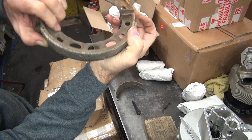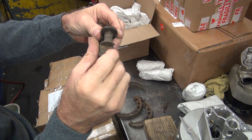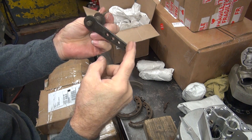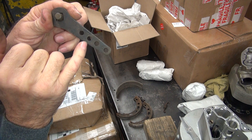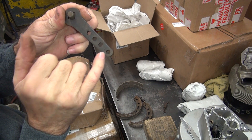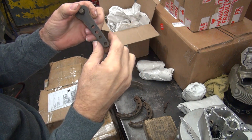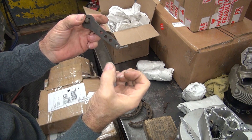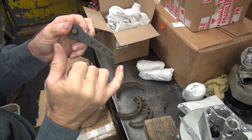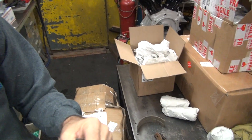So it goes in there like that. This shoe is damaged. And this here is the brake lever that goes on the end of your cam, and that's where you get your strength to work the shoes. The early ones in the 30s had four holes in it. So you got Solo - this right here is the second hole - and then Trike was way out here. That gave you more pull and more leverage on the shoe so you can stop harder, but you used up all your free play so it didn't really work that well. When you're a little bit closer, you had more travel but less mechanical advantage - you had to squeeze harder. But they had adjustability. Later on they just put one hole in there and you couldn't do anything. In the 30s they figured you're smart, let's put it where you need it. But they found out early on that riders are not smart - neither are the Harley mechanics.